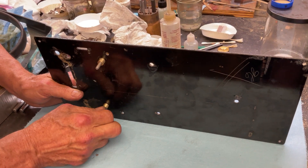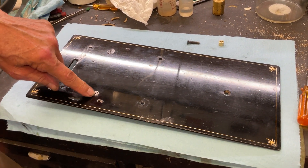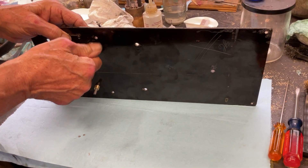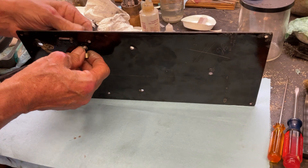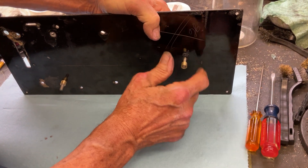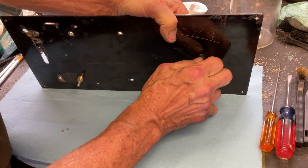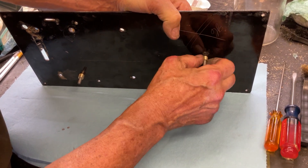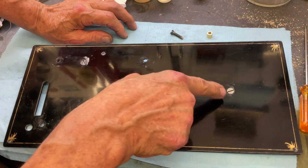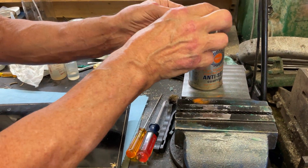And I forgot to tell you people this too — you have two black screws and you have one polished-out screw. That screw there goes in that hole, so let's just move that over there. Seriously, what difference does it make which hole the screw goes into? Well, that screw is seen from the outside when you put the top plate on. The back two screws are hidden, and this one is out in the front. So you have the two black screws, and then the top casting fits here, and where the mandrel is right here, you can see that screw — and that's where they polished that out. The factory nickel — just little things in life with Edison, it's kind of fun.